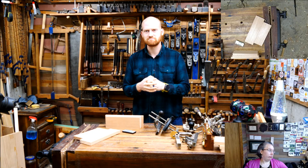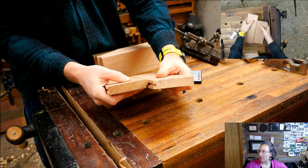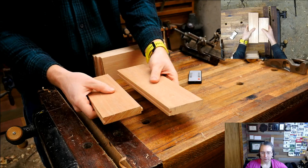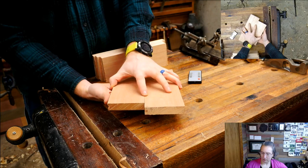First, let's actually show what is a tongue and groove joint. A tongue and groove joint is basically that. It's a tongue and a groove, and when they go together, they join the boards, and so they theoretically should have a nice flush face across here. You see these a lot in flooring, so that the two pieces don't want to slide past each other this way. They're not really a structural joint, but they do keep the two pieces level so that one doesn't push past the other. Another place you commonly see them is in joining pieces together for tabletops. The big reason for that is just to make it easier to joint them, so everything is flat when you go to glue them together, kind of like with biscuits.